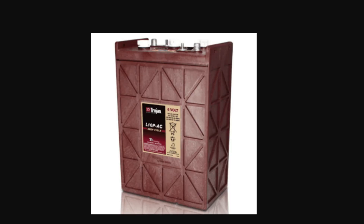For most off-grid applications, the flooded acid battery is the best suited for its purpose. There are also different voltage ratings to consider. For most purposes the standard 6-volt cell is just fine, but there are some advantages to the 2-volt single cell batteries, especially for those with a really large battery system. If one cell in your large battery bank goes bad, it would be much more efficient to replace the single cell rather than replacing an entire 6 or 12-volt battery — because a 6-volt battery actually has three cells built in together.